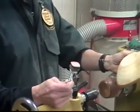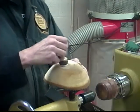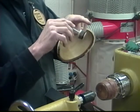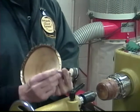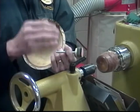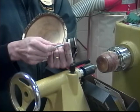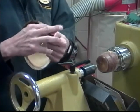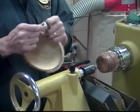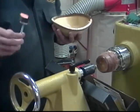And then I don't use this often, but it's come in real handy. This is just a small little sanding disc. It would work good if you were trying to not run over the edge on like the base of a bowl. I've used it inside of small narrow vases or vessels. Basically, I just took these screws, I thought I was using carriage bolts, so they got smooth heads, but they got the square shoulders. I drilled a hole in a little bit of plywood and snugged it up tight with a nut. And then I just glued the foam on there. This particular one, I should glue on a nice piece of Velcro, but at the time I didn't have what I was looking for. This still works just fine, because it doesn't have a lot of torque on it, and it works good to get into those small areas, and almost costs nothing.